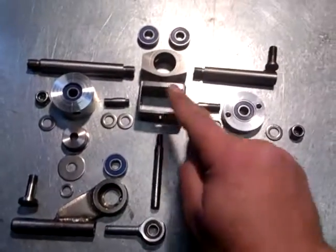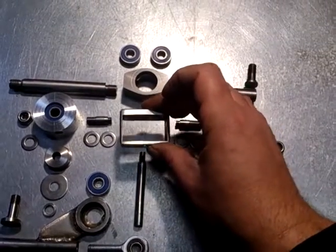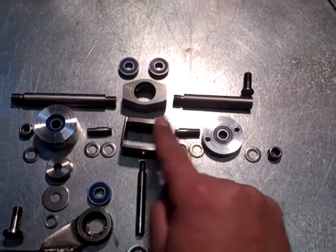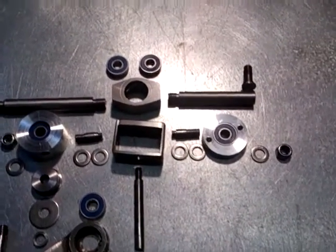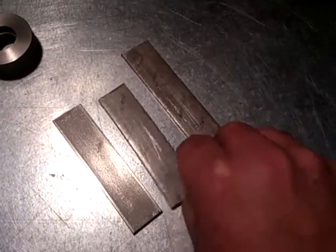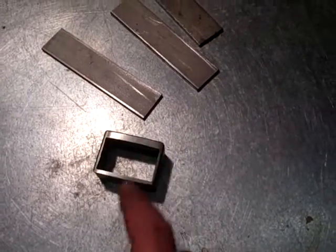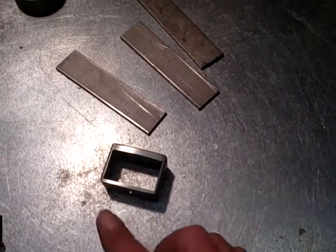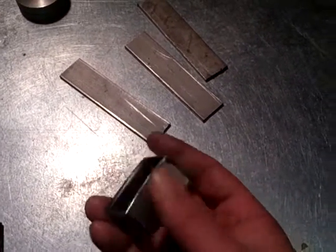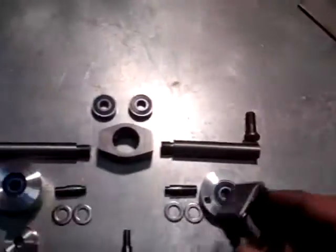This is probably the most important assembly here. This is a cage — it's going to house the main stick bush. That was actually made by me from pieces of flat stainless steel bar. To give you an idea, these are the pieces: 6mm on one side and the rest is 3mm. I cut them and shaped them, TIG welded them together, and then ground all the welds off so it looks quite nice and sharp and smooth.